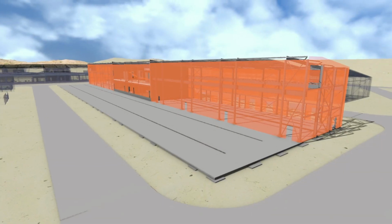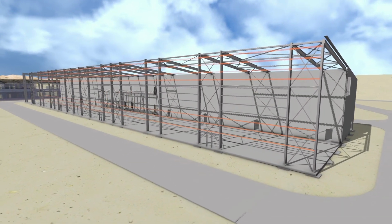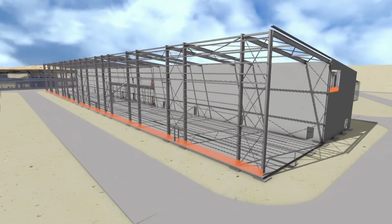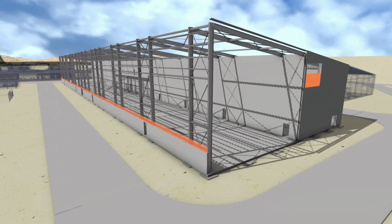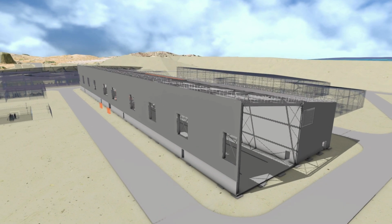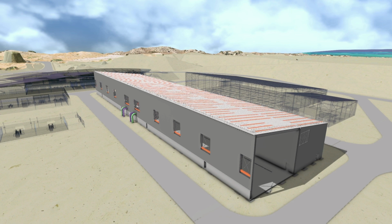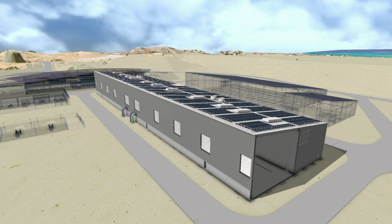To address noise, the west wing contains the pumps and energy recovery device, while the east wing will contain the RO racks for both the first and second pass. As well as physical separation of the two zones to maximize acoustic performance, precast concrete wall panels will be used in conjunction with noise-absorbing Dura panels in the roof. Temporary works have been assessed to address the safe installation of the roof, the solar panels and ventilation systems.